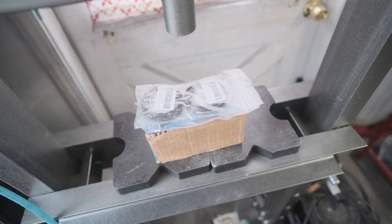Now I'm just going to wait for the rear knuckles to finish baking in the oven. I shot more of that Blackjack powder from Prismatic Powders, like I did on the front knuckles — it's a really nice flat OEM black and these things turn out real nice. For Blackjack it's like 15 minutes at 375 degrees. The way you determine the temp is using one of these little infrared temp guns — you open the oven door, shoot the parts, and once they're up to temp you set your timer. It always says on the bag from Prismatic, so you'll never forget.